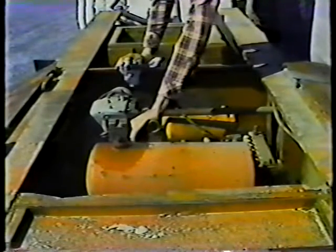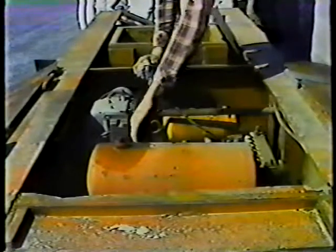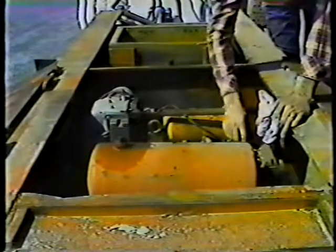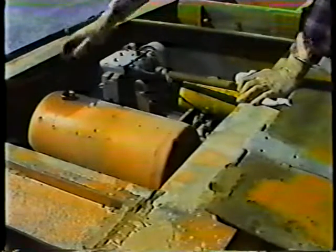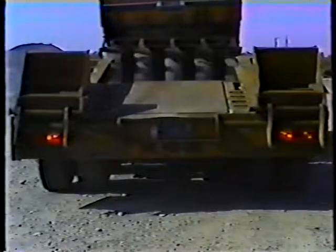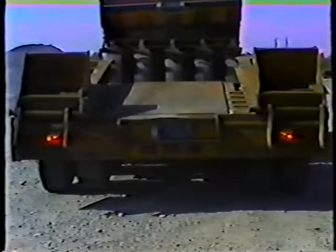The next step in the pre-trip inspection is to check the trailer motor. Check the engine oil, the fuel, the battery, and the hydraulic oil. Check the trailer's lights, both turn signals, the brake, and the backup signals. If none work, recheck the electrical connector. If some work, check for burned out bulbs. Also, make sure your emergency warning light is working.